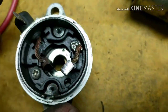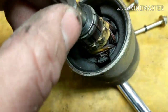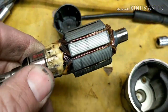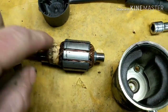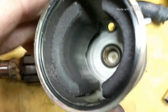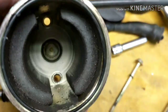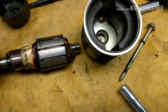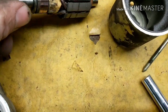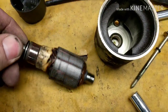So what we're going to do is clean this up with electrical cleaner — clean the hole inside here. We're going to take the inside; see it's all dirty inside of there. Let me pull it out for you. All right, that's all pulled apart. You want to look all through here and make sure you don't have any burns or anything, any marks, any rubbing. I just got some kind of dirty crap in there, so I'm just going to clean this all out really good. All right, electrical cleaner, and then we'll put it back together again. I'm going to clean all this up — check all my contacts and make sure these wires and everything is good. And it all looks good, so let me give it a good cleaning and then we'll reassemble.